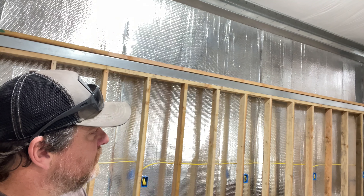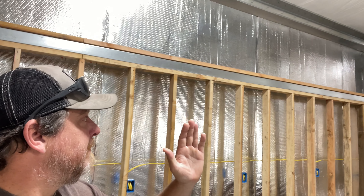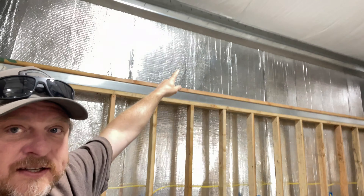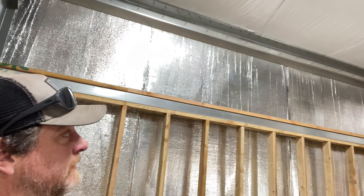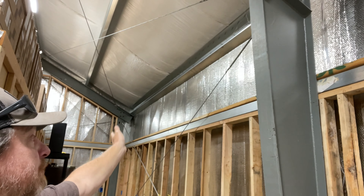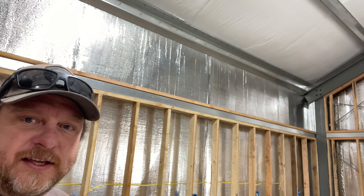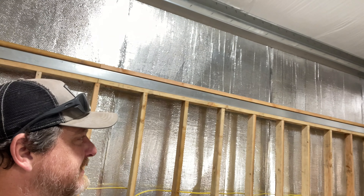I want to make sure the wall is straight and not wobbly at all — very tight. I'm going to pin it up against the white insulation on the ceiling with long 16-foot and 12-foot 2x4s. This is a big 40-foot run and it's going to be quite a challenge doing it alone, so let's see how I'm going to suspend all these and keep them from falling while I'm working.